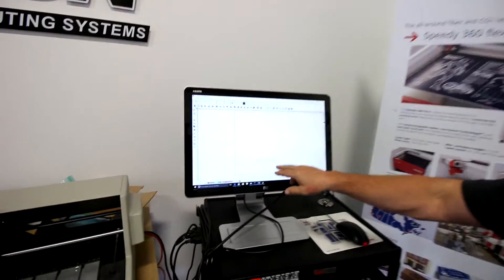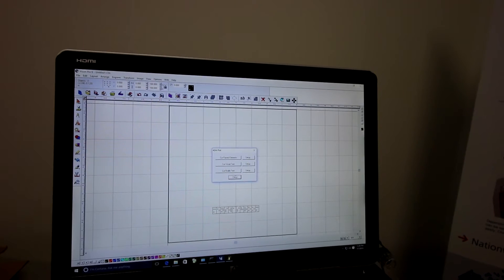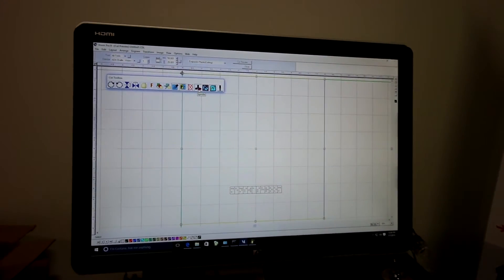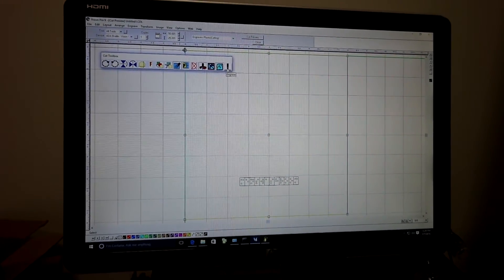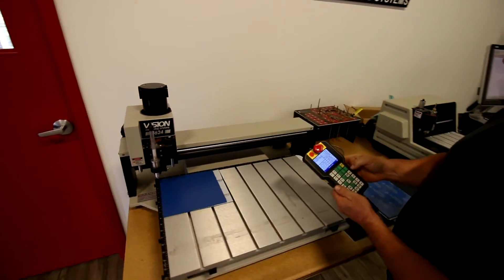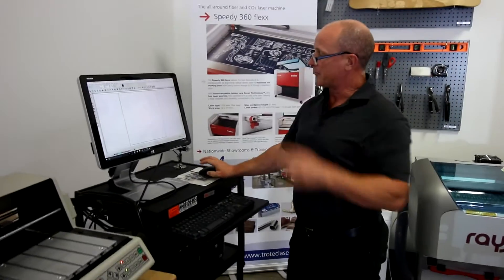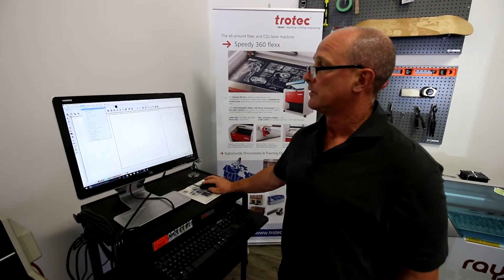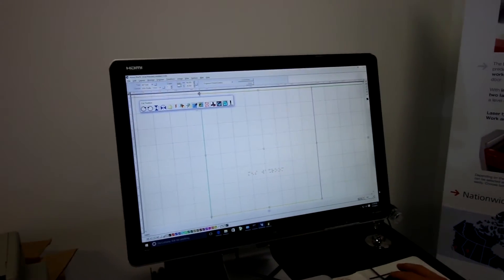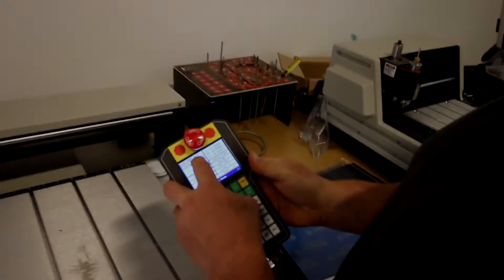On my screen I've set up my 8x8 plate and I've got my Braille cells set up. All I need to do now is go to Engrave and select 'Cut Braille Text.' I have my vacuum set up, the FOX sensor set up, my spindle going, and my Braille set up. I go to Engrave, come over to my pendant, and it says 'Press Start to go.' I press Start.